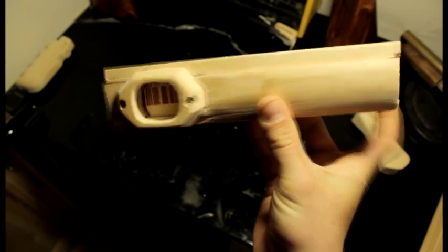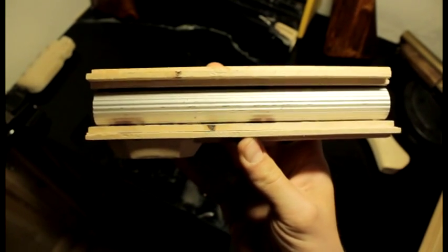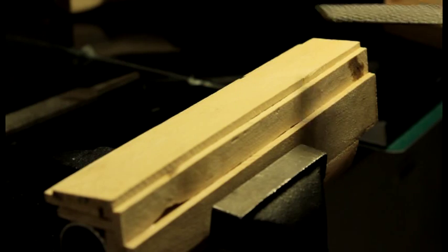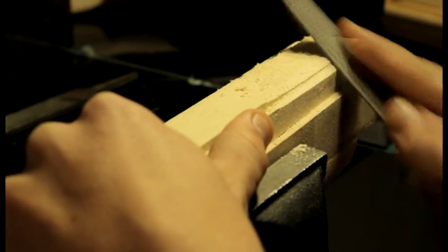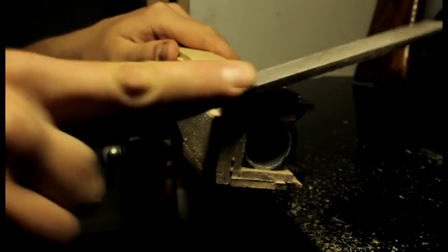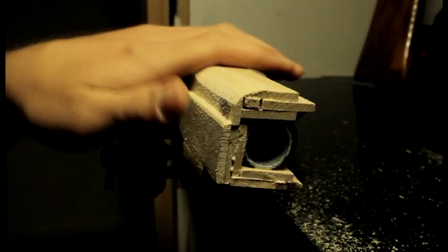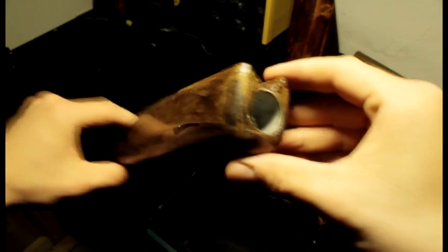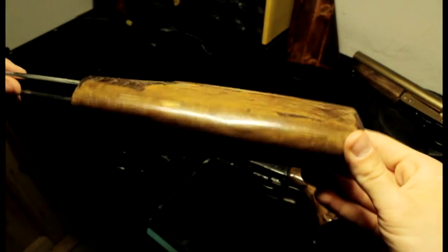After you glue the sticks to the pipe, it should look something like this. Please ignore the angular attachment at the side — this piece is from a different project, but it's still the same principle. Then you'll just need to grind the edges until you get the shape that you're after. Start with the rasp, then use a finer grade wood file before you move on to sandpaper. Now the rest is pretty basic: fill in the holes with spackle, sand it, install two small rods like on mine, and finally conceal the pipe and rods using the spackle as well. Then all you need to do is sand it some more, right before you apply the wood dye and oil. And then you're done — it should look like this.